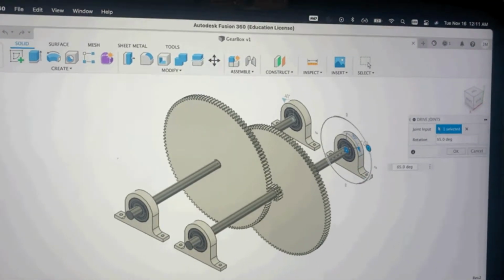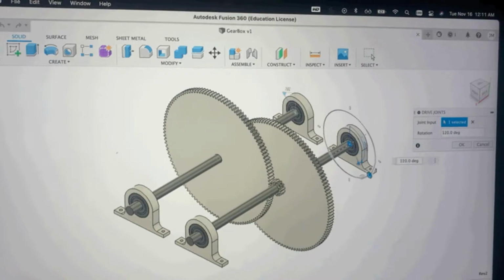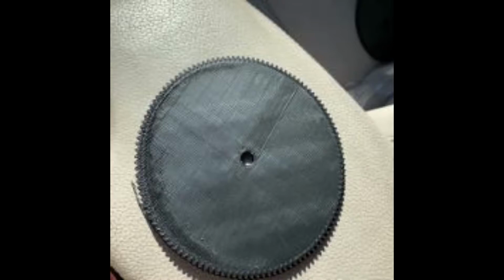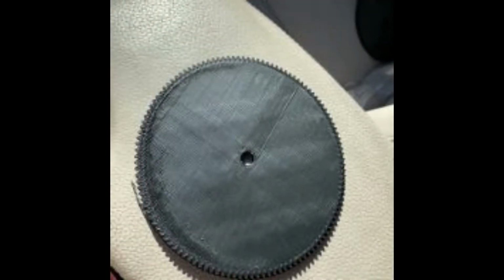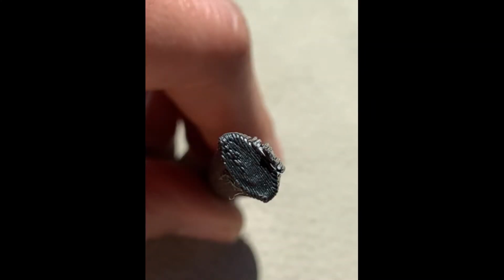So we had to work around these problems by trying to sand down the inside of the gear hole or printing new ones. Another problem we encountered was warping of the gears and shafts. The circular shaft was deformed due to the printer bed not being calibrated, so the gears came out oval shaped, because the XY plane wasn't calibrated correctly. But once we got these issues resolved, the prints came out pretty smoothly with no warping or deformation.